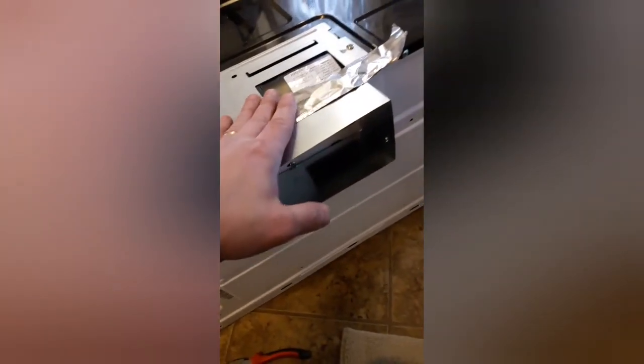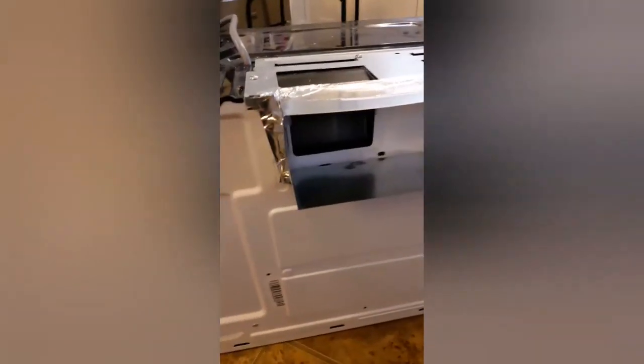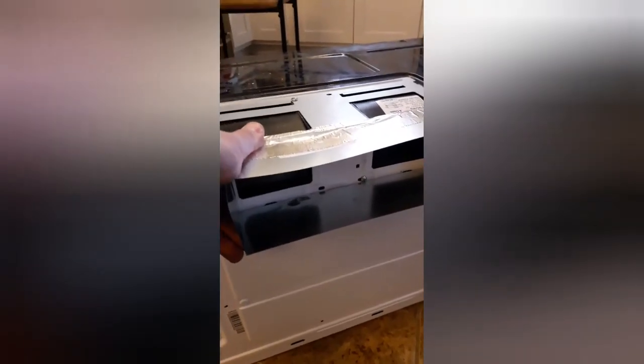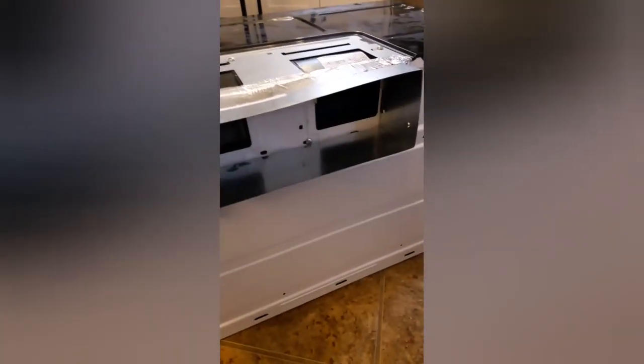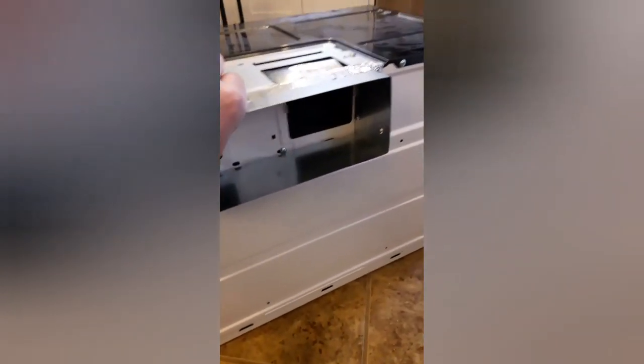And also that it stays on there and creates a good seal. You can see I've gotten this all nice and taped up. No leaks in there, so every time I run it's just gonna blow nicely. Like I said earlier, I didn't put a damper in there just because I have one on the outside wall mount, so I'm just gonna use that one. Primarily, I would have liked to have a second damper in there, but the previous owners didn't leave me anything, so I had to kind of custom make this.